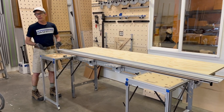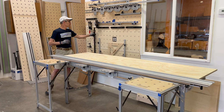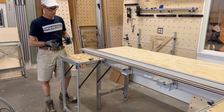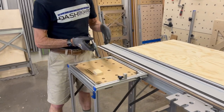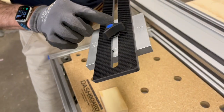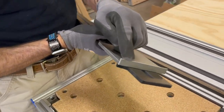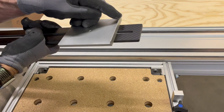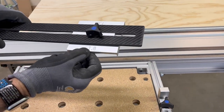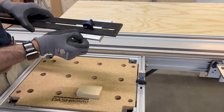Now we want to set the dimension of the cut, and this is where the rip gauge comes in handy. The rip gauge is available in three sizes and consists basically of a plate and what we call the extension. The plate has a tab, and that tab represents the thickness of the blade on your saw. We have these in three sizes: 1.8 millimeters, 2.2 millimeters, and 2.4 millimeters, representing different blade thicknesses on different machines.